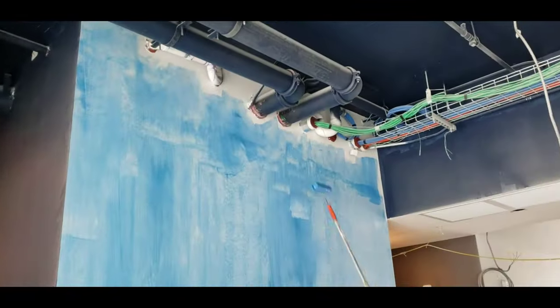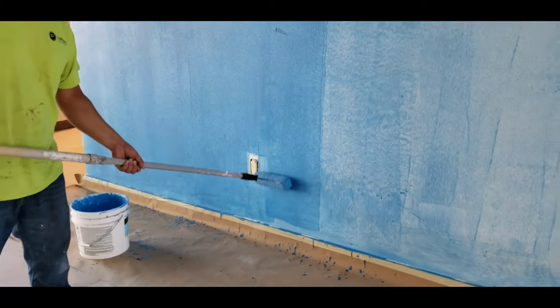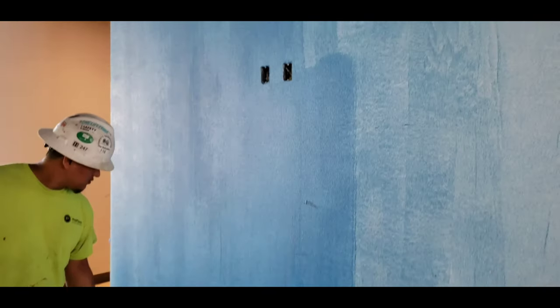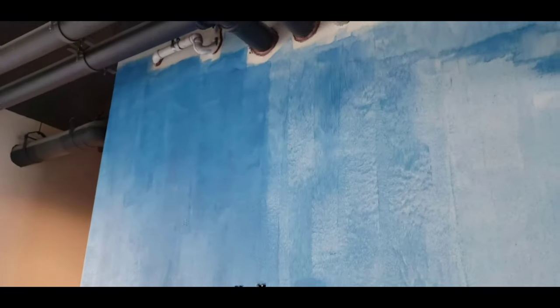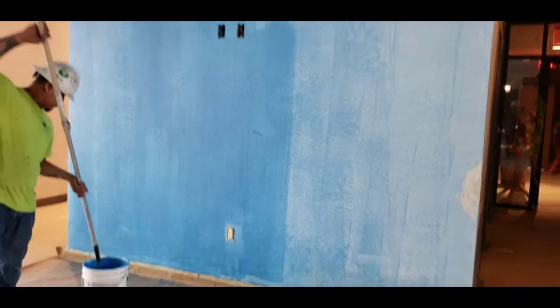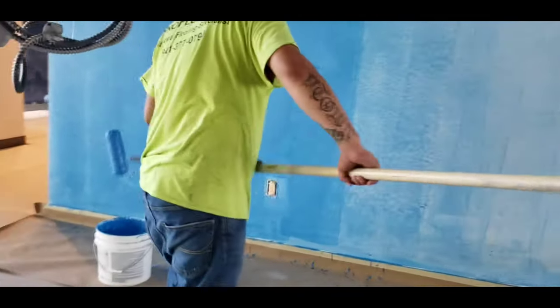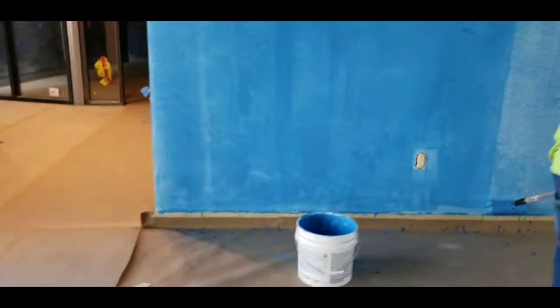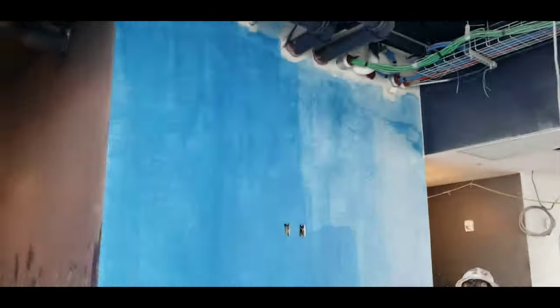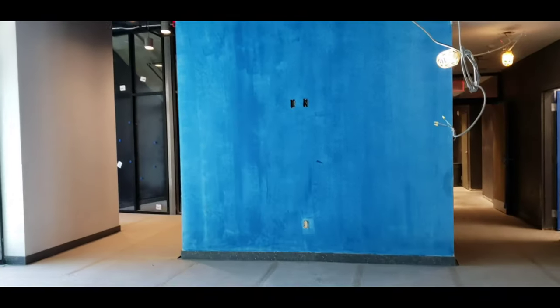Looks like we're just about done with the first coat of priming. That's correct — we have to use two coats to make sure it's perfectly done. If you notice on the left side of the wall it has the darker blue, which indicates the second layer of primer, and that's the way it should look. On the right side it's only the first layer, which clearly needs the second coat. Anytime you're using a primer, I would always recommend two layers for a good application.